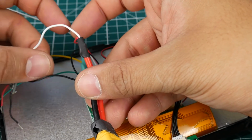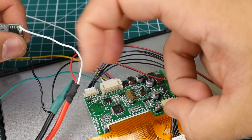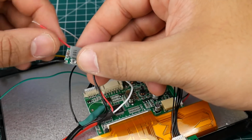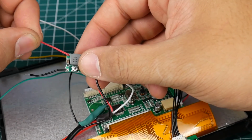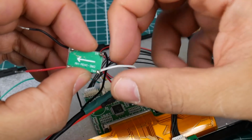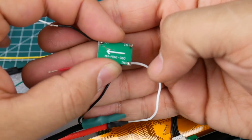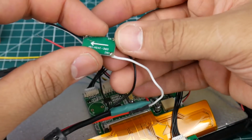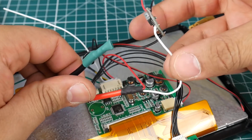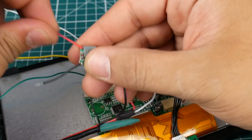Now on the other side, we're also taking the direct power from the battery, which is, let's say, 12 volts. And we're passing it to this voltage regulator, which is going to change it to 5 volts so we can power our Fatshark modules. As you can see here, we've soldered the in positive and the in ground right there, just soldered to this guy right here. The positive to positive, the ground to ground. Nothing too crazy. So now we're left with the out.